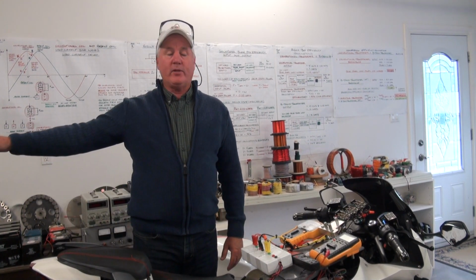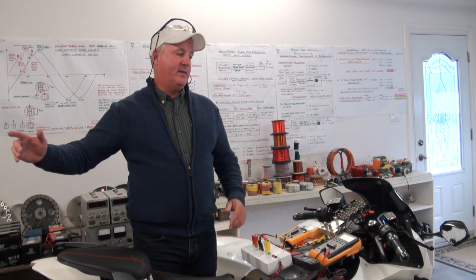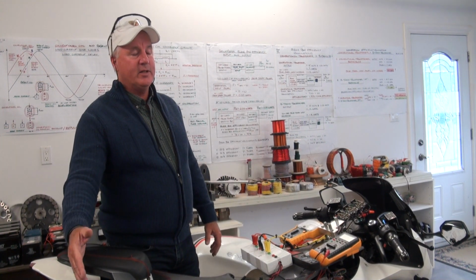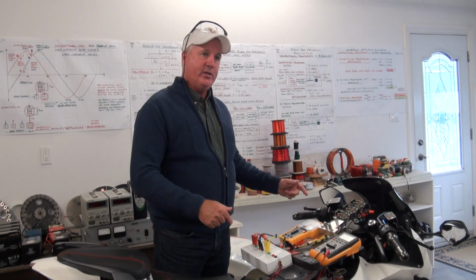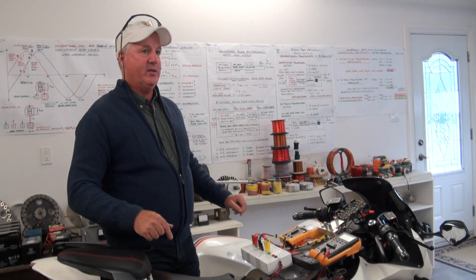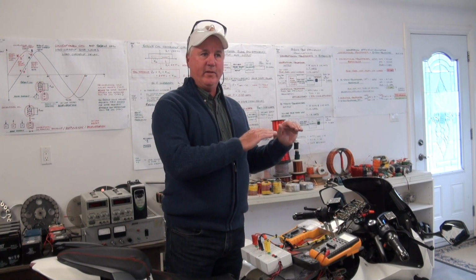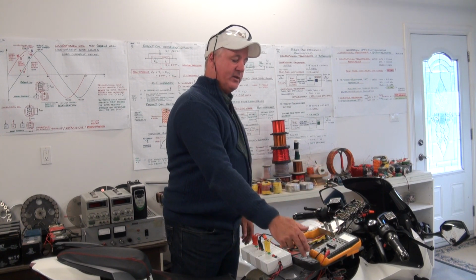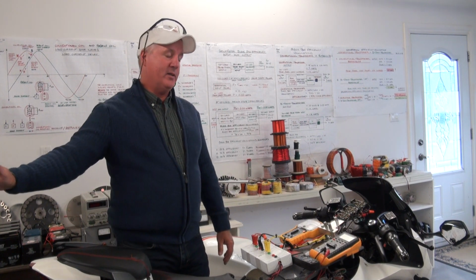and put that coil in that was delivering 3.5 amps, then you get the same effect but more. The more current you deliver from a RegenX coil, the more acceleration you get. The more current you deliver from a conventional coil, the more deceleration you get. So above 30 kilometers an hour, regenerative acceleration, I'm going to show you that. Each time I add one, this current meter goes up and the speed goes up. I hope we will see it on the oscilloscope.